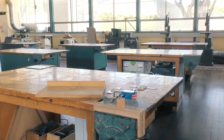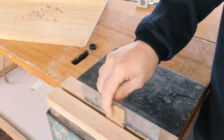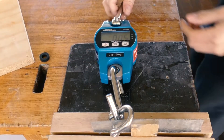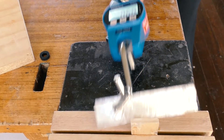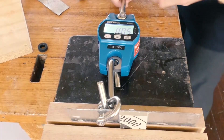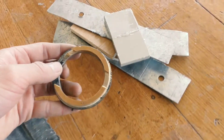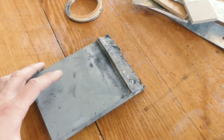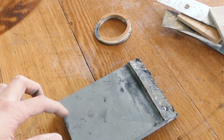So now I might try some different materials — this time without layers — like this piece of old acrylic and PVC. I glued those two different materials to some scrap bits of metal with epoxy and then did a break test. Acrylic broke at a mere 60 grams and PVC broke at a weak 10 grams. So glueing a piece with epoxy to metal isn't really that strong, and instead I'm going to do what I'm really excited about from the beginning: mill the ring out from an entire piece of metal.